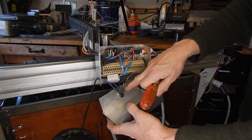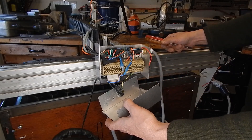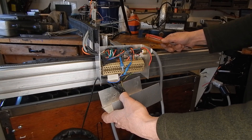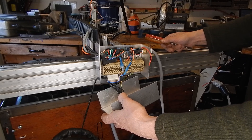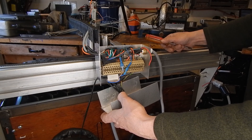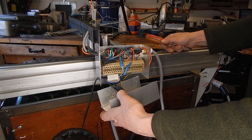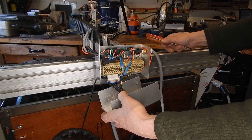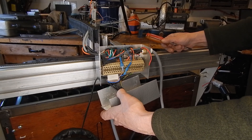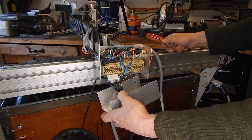These connections all go into this cable. This is an 18-conductor shielded cable specifically made for automation and mechanical controls. I did have to buy this — I didn't have anything in stock. Usually I try to use everything I possibly can from my junk bin, but the idea of stringing together and shielding 18 conductors into some sort of monstrosity of a cable didn't appeal to me. It was about $5 a foot and I ordered 10 feet, so my total cost for this machine increased by about $50.